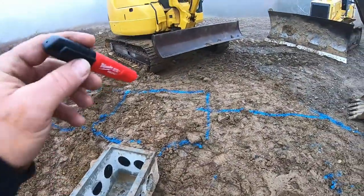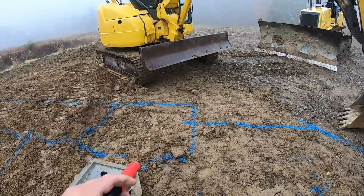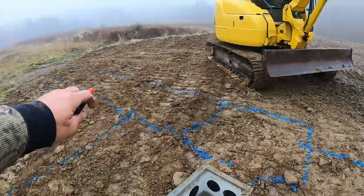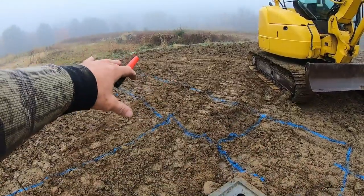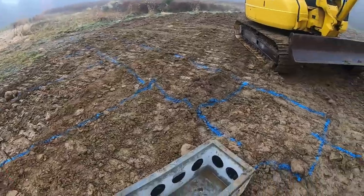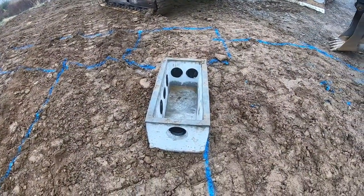I do my math to get to the bottom of the tank, and the math to put the stone in the bottom of the hole. That will be how deep I have to go on the trunk. That's what we call this right here, where all my pipes of solids come in and then into the perforated trenches, which are these holes here. And yeah, let's get started.